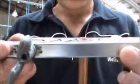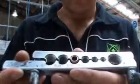We're going to find the size that the pipe is going to fit into comfortably. In this case it's 3/8 — that's 3/8 of an inch. I've got that through a fraction, probably a couple of mil. Now I need to tighten it right up, both ends. It's quite tight so I'm going to use a crescent to tighten this end up — it gives me more leverage so it's not going to slip out when I use the other piece.